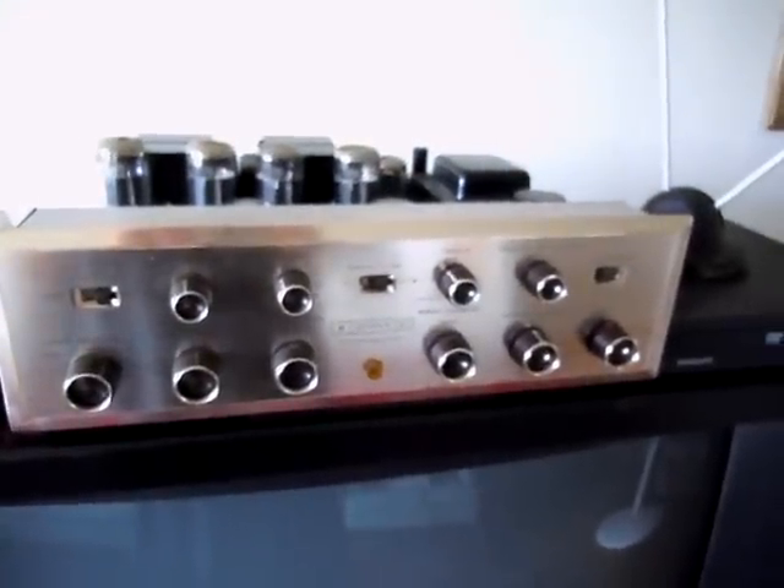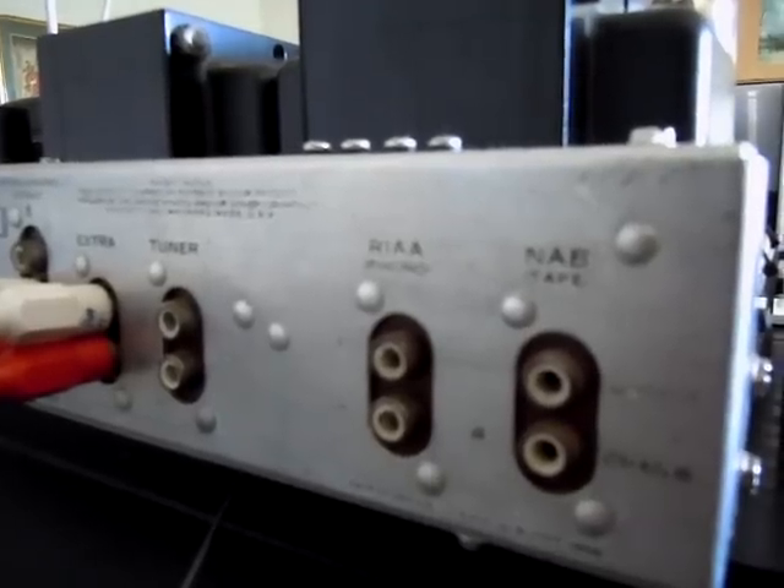I have it kind of easy here because I have a vintage Scott tube amplifier — love these things — and it has a simple input on it marked phono, which you need. The reason why you need it is because the average signal of a turntable is maybe 5 millivolts for a magnetic cartridge. A CD player, iPod, or DVD player can be anywhere from 500 millivolts to about 2 volts, depending on the dynamic range capabilities of the piece of equipment. So connecting an old-style turntable to a new piece of equipment that doesn't have a phono input yields very little to no sound.